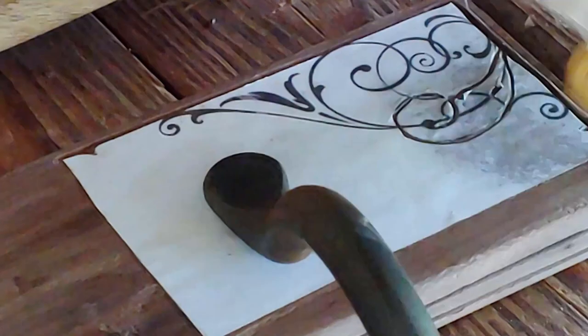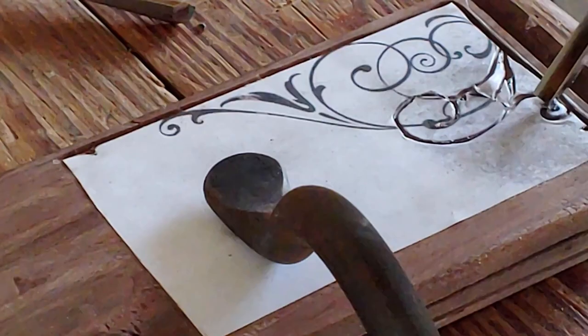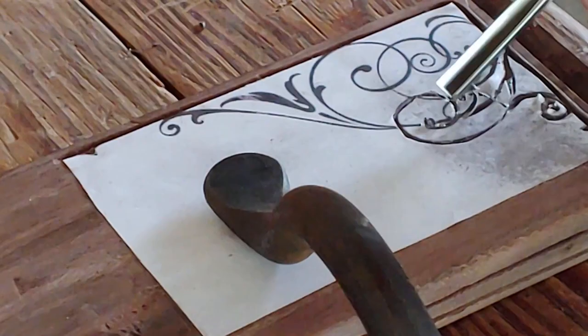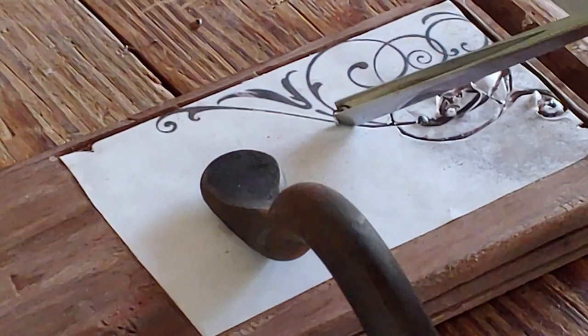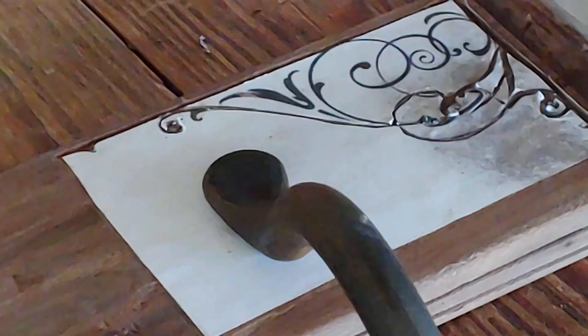So when you start carving, it's really important to pay attention to grain direction. You'll see the more that you do it, that grain direction does come into play on everything. Carving through the board, the grain changes on you, and then all of a sudden you've got tear out, or you've lifted up some fibers and it doesn't look good. As you continue to practice carving, you'll learn to read that grain a little bit better and see how it works together to make those nice designs. It really makes a difference in your overall finished product.